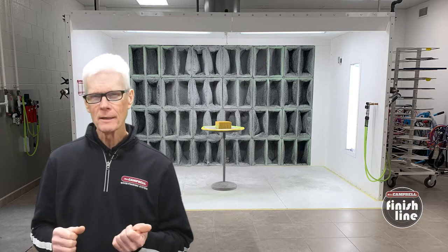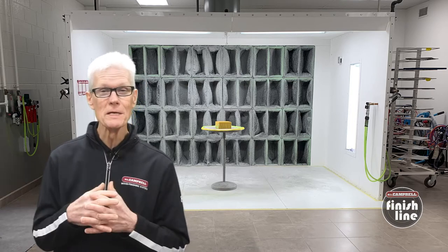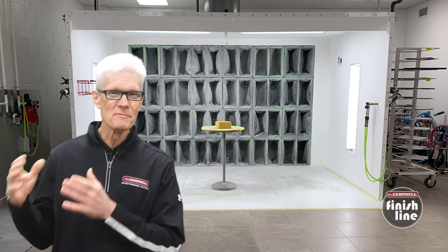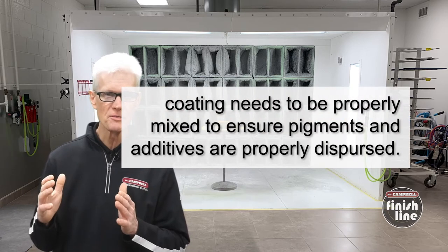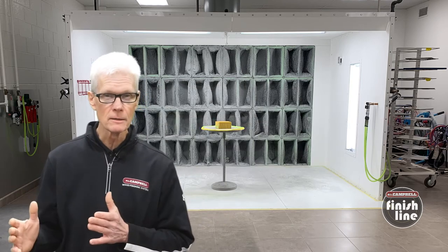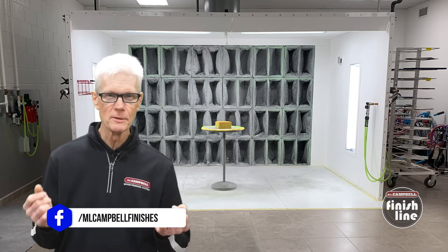If it's in your coating, it could be pigment or colorant that has re-agglomerated into larger particles. It could be that your coating material is just old, or it was not properly mixed. It's critical to mix your coating thoroughly before you spray it to get consistent sheen and color, but also to make sure that there are no chunks or particles of material in the coating.